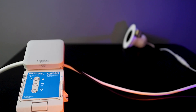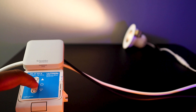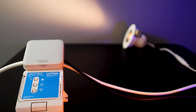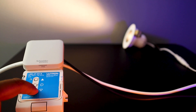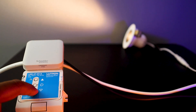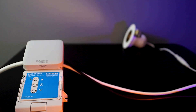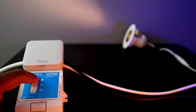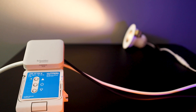As I power back on the equipment, the light fitting automatically switches on. From the Lutron module itself, I can quickly switch the light on and off using the middle toggle button. I can also lower and raise the light using the up and down arrows, which allows the electrician to quickly test the wiring. Now that the wiring is confirmed correct, let's add this circuit to the existing RA2 Select system.